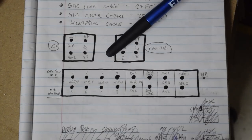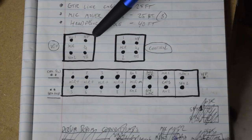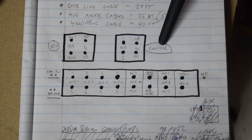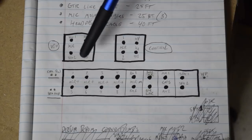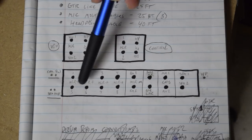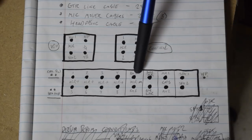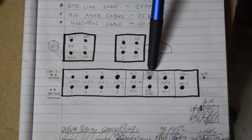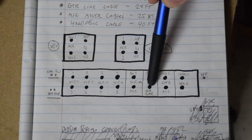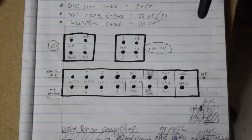All those live room cables correspond to connections on the wall plates. In the vocal area of the live room we have two mic inputs, a headphone out, and a talkback out — and the same setup mirrors in the control room. The main panel in the live room has eight XLR mic inputs, plus the two room mics going to the mudroom for reverb. There's also an XLR connection for the storage bathroom area and the straight-up guitar cable running there. Mic mover one, mic mover two, and the two guitar speaker cables are also on this panel. I'll drill another hole for an additional headphone out.